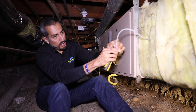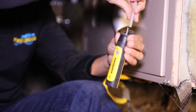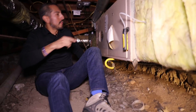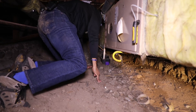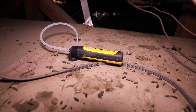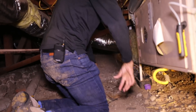What you want to do is insert the probe and then easily zero it out right before you take your measurement. Tap on the power button, you'll see a blue light flash, and you're ready to take your measurement. Put the hose back on and stick it back on there. On the supply side, I've done the same thing — zeroed it and positioned it onto the supply side using the magnet, with the static pressure probe in the direction of the air flow. The beauty of a wireless probe is that we don't have to sit and do the diagnosis in this space — especially on a hot day it would probably be upwards of 120–130 degrees down here. Let's go outside and see what the numbers are showing us.